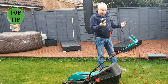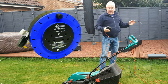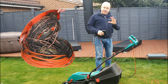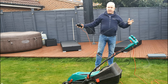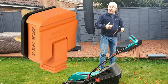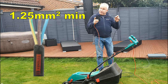If you need to use an extension lead to reach all the extremities of your garden, avoid buying one that's way too long — especially one of these cassette reel types. If you do use a cassette reel type, make sure to uncoil it every time you use it because if you leave them coiled up they can overheat and catch fire. Preferably buy or make an extension lead just long enough to reach all extremities from your plug-in points. Use a tough rubberised socket at one end and a tough rubberised plug at the other, and make sure the cord is good quality — preferably a rubberised sheath — with a cross-sectional area on the conductors of at least 1.25 millimetres.